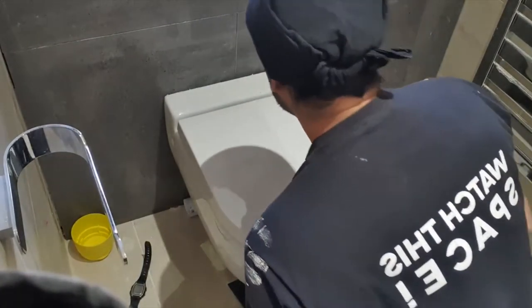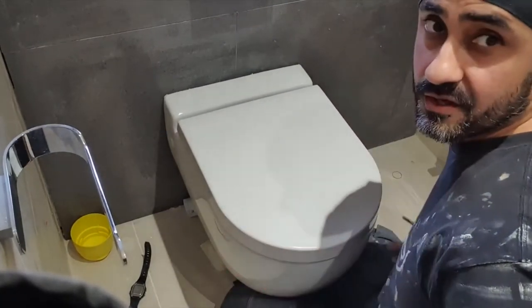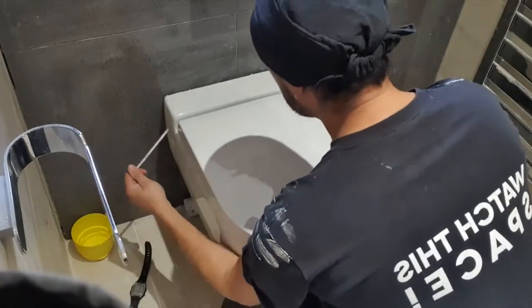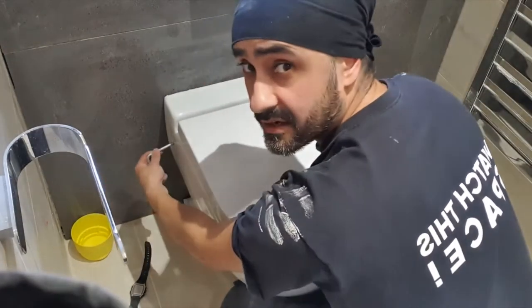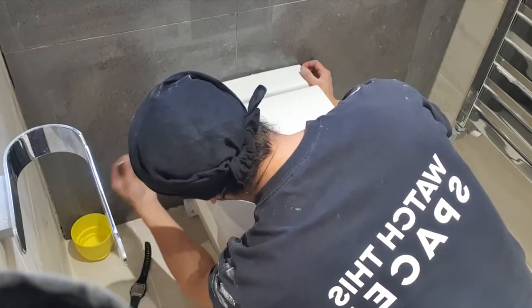Oh, it's a hard one. Right, have a little look. You've got to get your hands in there, two hands, put lots of lubricant on the Flexi, and then just push it on. You see that in there? I've pushed that on. Right, let me put this on. That's it. Just make sure, if you're on your own, use your legs to keep it propped up. Keep it pushed into the wall. Allen key in. It's always tougher when you're using the Flexi, guys.